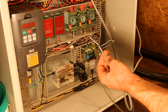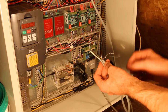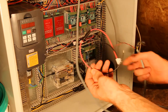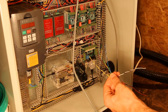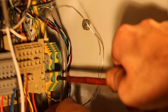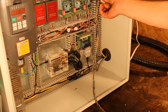Now that the cables are running into the control box, we need to see how much we need to remove from the cable's outer sheath to reach all the required terminals. The earth wires must connect back to the earth terminal inside the CNC enclosure. I also need to connect the red and black pair in the main cable to my 24 volt power supply via the fused lead cable assembly. The white and black pairs in each cable connect together using the connector provided. The other four pairs of cables need to connect to the breakout board. The two cable screen wires connect to earth, and then the two black and white twisted pairs connect together with the connector.